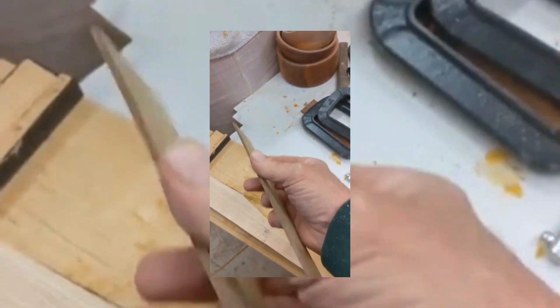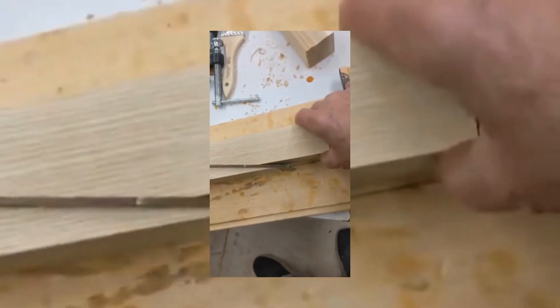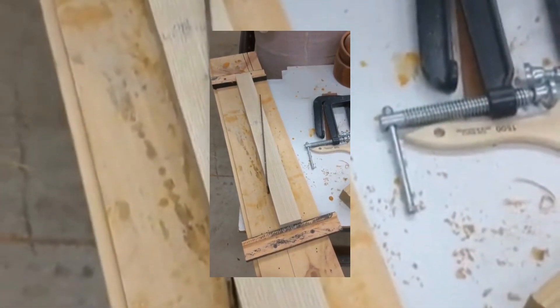Here I have the two pieces that I cut earlier, right down the middle — there's the middle. This piece that I cut out is really one saw blade thickness. I put it in between these two and put this back together like that. I have this little jig fixed so that when I get finished putting this together it's as long as it was to start with — otherwise this gets out of whack, one side farther out, the other side farther in. If I have this just right, I put a line across there and adjust this end piece to make it the right length. Now I can glue that piece together as the next step in the process.